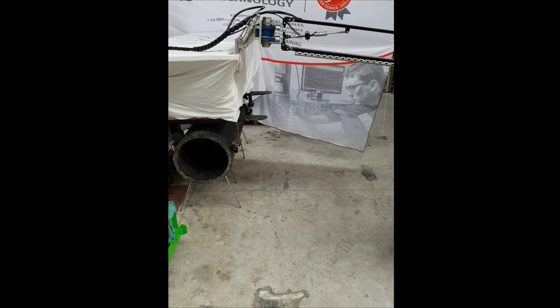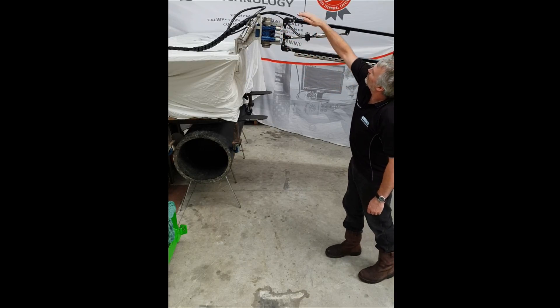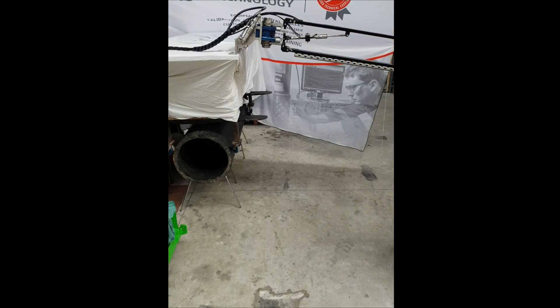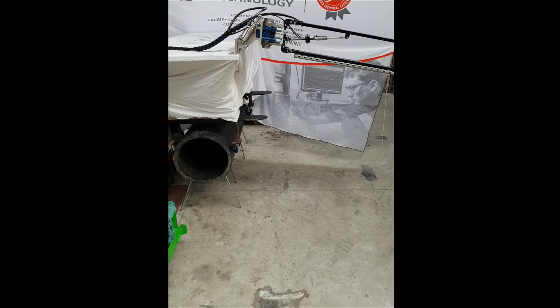There's another 45° to go up from there. What I'm showing you now is the cable tray running underneath. So the cables out to the camera and lights will simply clip in. On the top, we have the hydraulic hoses routed through the inside of the body, so they're fully protected — those hydraulic hoses going out to the pan and tilt, fully protected and away from the environment.